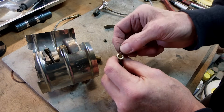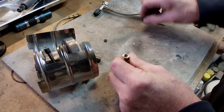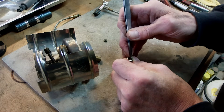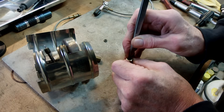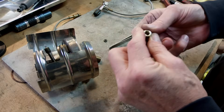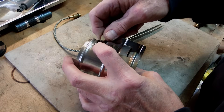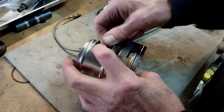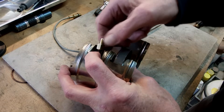At this stove end I'm not going to use a flat washer because the surface is not flat in there - it's slightly angled. Instead I can use these Viton o-rings. They just go inside here like this. Only one is necessary but I'm going to send my client an extra one. We fit that down in there and it's going to roll down on there and seal it in.